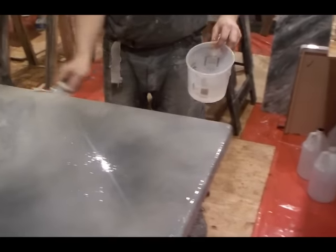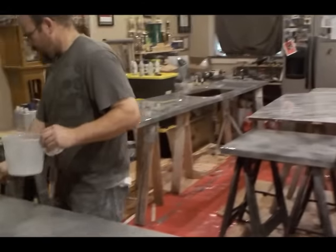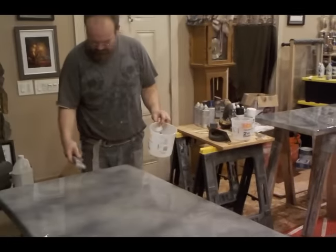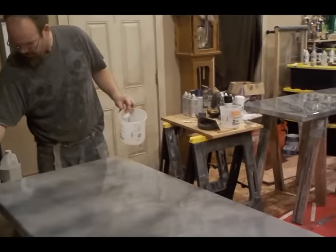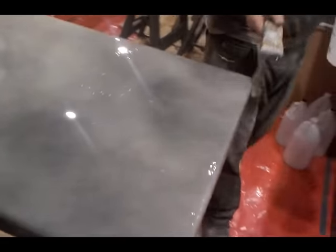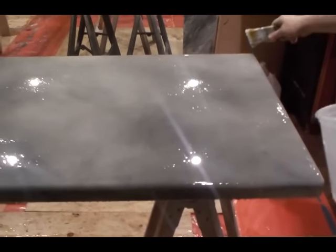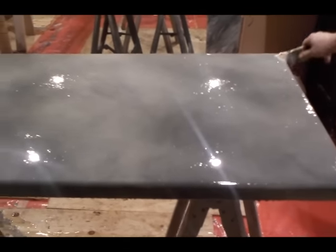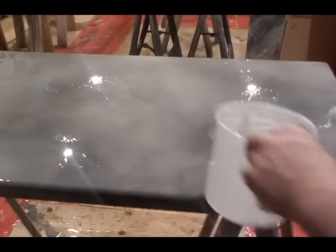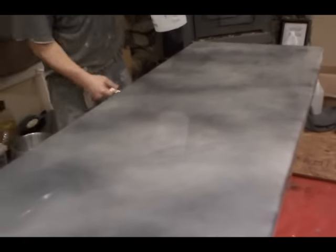This could be a finished countertop — that could be as simple as that. Some people who want a very simple-looking countertop can just spray their MDF after the base color and do a little bit of accents. This could be a finished top just how it is. Some people don't want wildness in their countertop — they just want something simple and elegant, or they want it to look like concrete. That's exactly how you get it to look like concrete. All the spray paint we use is just a rattle can, oil-based, usually a semi-gloss. You don't want to use a flat.